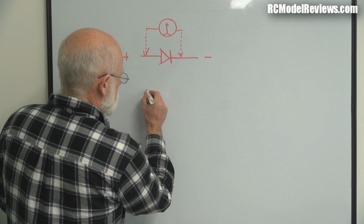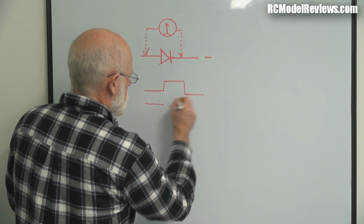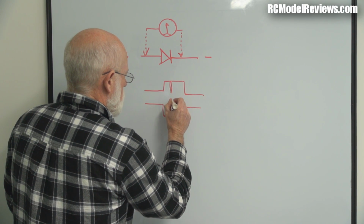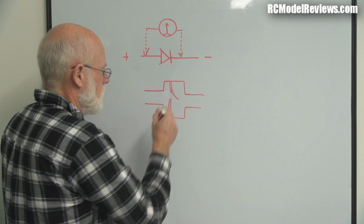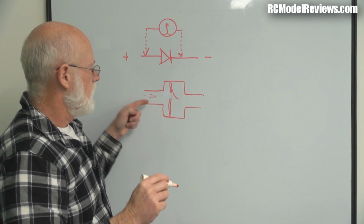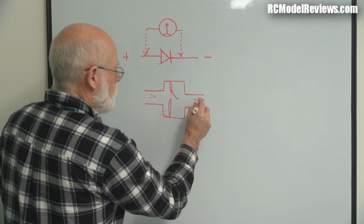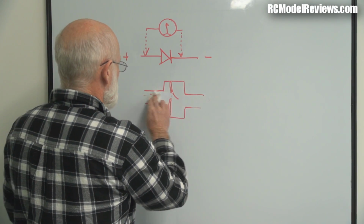If you have a tube, let's have a tube here, and then you have a little area like this. I'll try and draw this the best I can. And if in here you have a little plate and you have a little valve on here, a little flexible membrane that can open and close, so it can go from that position to the open position, then when you blow air in here, it'll blow the valve open and the air can come out here. So it allows air or liquid to flow through a pipe. But when you reverse the flow, if you suddenly say, no, we don't want the flow going that way, wipe this out.